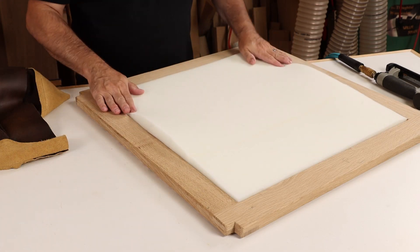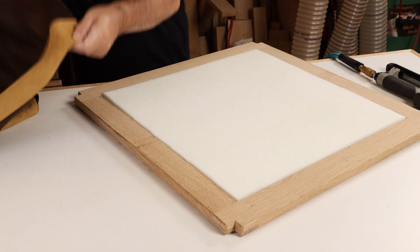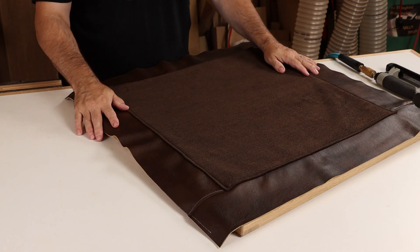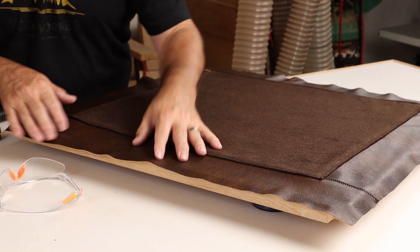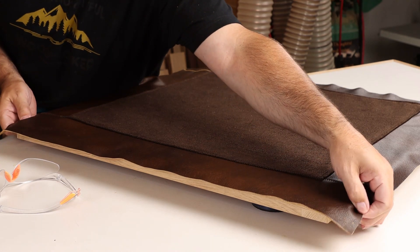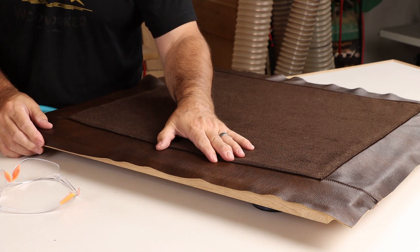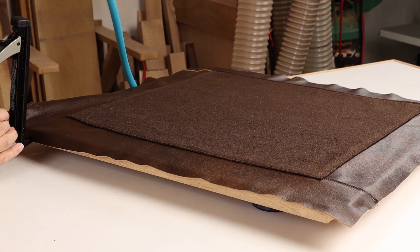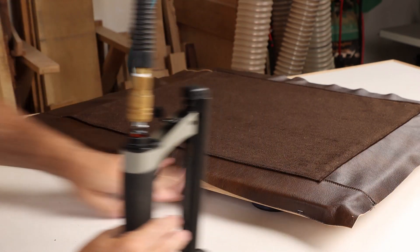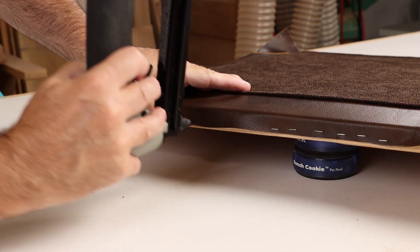We'll start by adding this one inch of foam, and this has to be in position before you trim things out because once that's locked in, the jute webbing on the bottom prevents you from retrieving it any other way. This is the front of the seat frame — we've marked that underneath for reference — but basically just center this cover over the frame and we'll begin tacking that in place with three-eighths inch staples. Then turn it around to work the backside of the frame and just start drawing some of the tension out as you attach that cover.